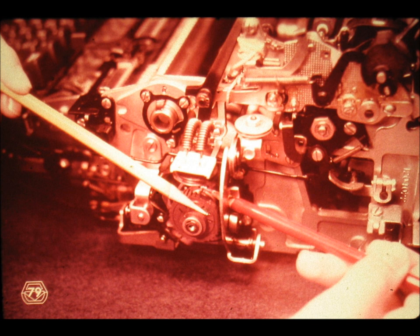Slide 79. The shift ratchet is just like a sleeve which fits over the right end of the shift clutch spring. When we turn the operational shaft with our hand cycle wheel, we provide the torque. The released shift ratchet allows the closing of the shift clutch spring. At its right end, the now collapsed shift clutch spring receives torque from the operational shaft, and as the spring turns with the operational shaft, it transmits this torque or turning force to the left end of the clutch spring where it is connected to the shift cam. The yellow pencil points at the right end of the clutch spring which is held by the ratchet or sleeve. The red pencil shows the point of connection between the left end of the spring and the cam.